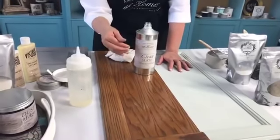The reason you need to clean first is that people use things like lemon oils, orange oils, or mineral oils on furniture — especially products like Liquid Gold, which was really popular in the 70s. We've got to get all that off. Also, a lot of people think if they have wax on a piece they can remove it with mineral spirits or lacquer thinner — that's not going to take the wax off.